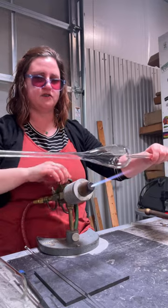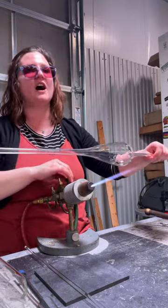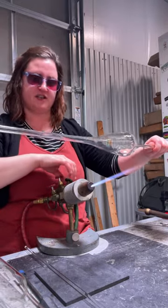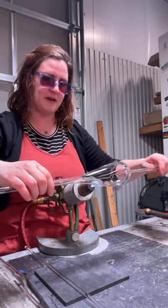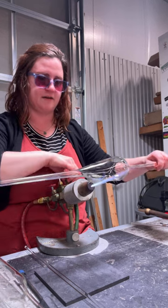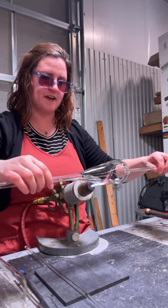So it's a similar idea. The way I like to do a flame cut is get a small, ripping hot flame. I have my inner oxygen just sort of raging, a little outer oxygen on if you want. I'm gonna pick an area and just concentrate the flame on that spot. It's gonna be loud, it's kind of annoying, and try not to move it at all.